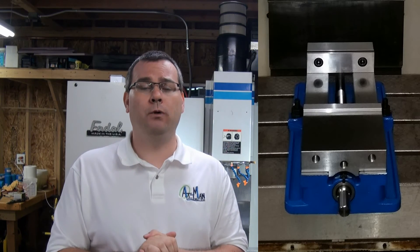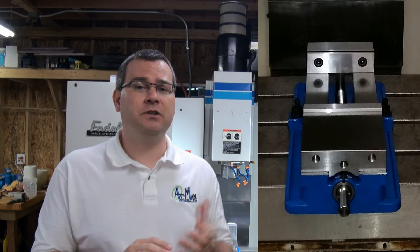Along with tool holding, we also have work holding requirements. The work holding requirements are fairly similar between a personal CNC machine and a vertical machining center. You're going to want a clamping kit, a machining vise, and some other work holding items depending on what parts you need to make. The vise costs are going to be slightly different, just because a VMC is typically going to use a larger vise than you'd see on a personal machine.